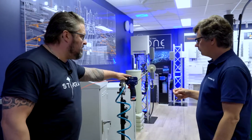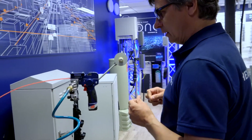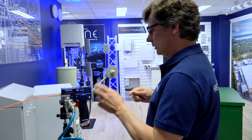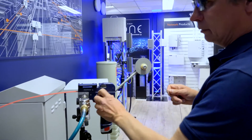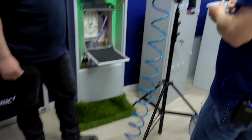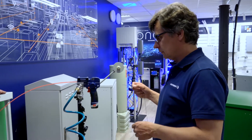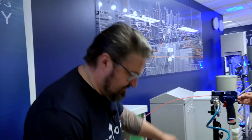Should we talk a little bit about the installation tool before we get started? We use a technique called jetting — a technology that uses mechanical pushing in combination with the flow from compressed air. When we start the installation, we always start with just mechanical pushing, and then when we need to, we add the air. I'll start the compressor and then run over to the customer side.